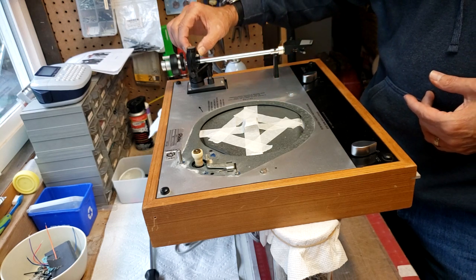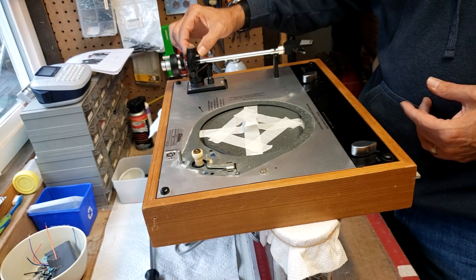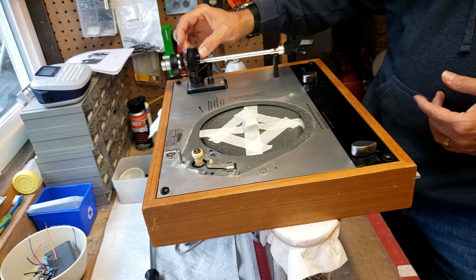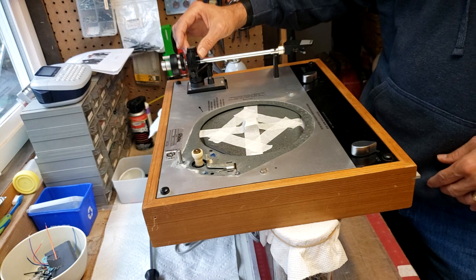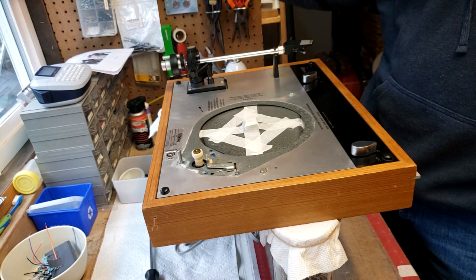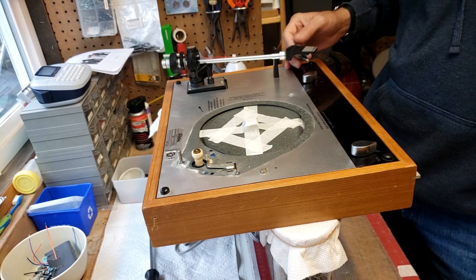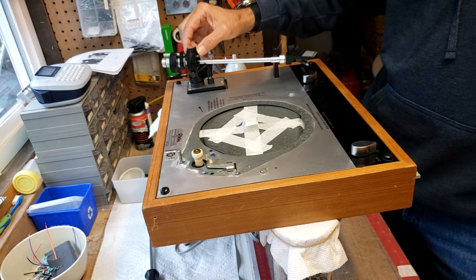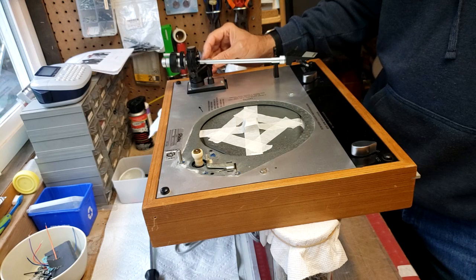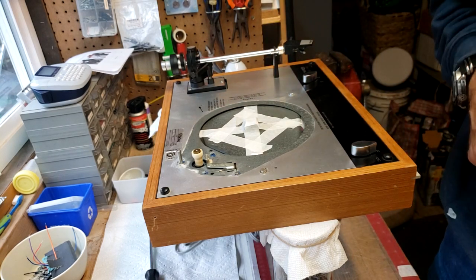Oh, and then of course I've got to add my weight onto the arm according to the Stylus OM10. So I'll be looking up the correct tracking force. I think it's around 1.5 grams or something like that. I'll have to look it up and apply that, and then I think I've got a playing arm. And the arm looks like it's working quite well. And then of course apply the anti-skate. So there you go. Thanks for watching.